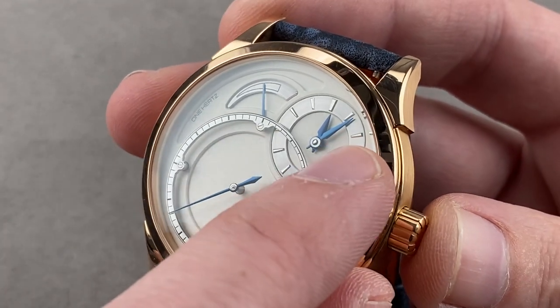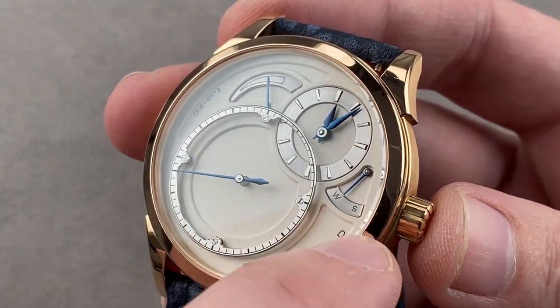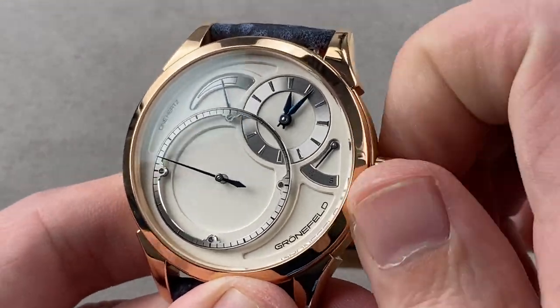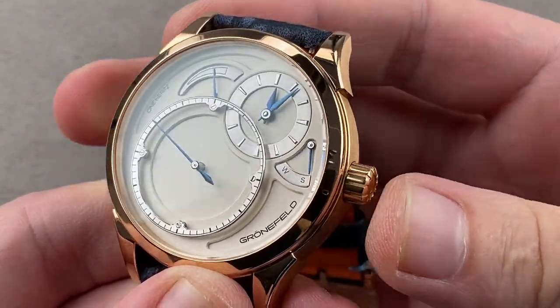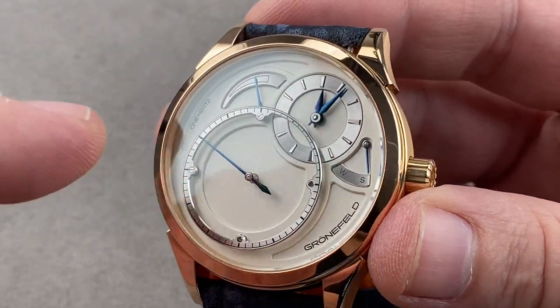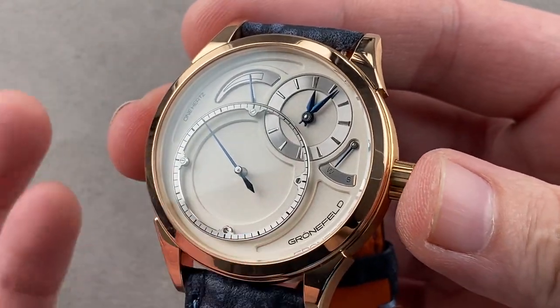You can see the hands are fired blue — all the hands are fired blue — with their centers mirror polished over a mirror-polished pinion. We have a dual-mode crown: in winding mode, you wind the watch normally. You don't pull this crown — you push it. Pushing the crown puts it in setting mode, which also activates a stop-seconds or hacking function for the deadbeat. Pushing back into winding mode, the deadbeat second resumes.